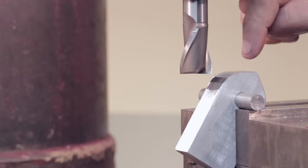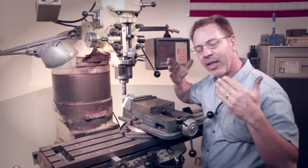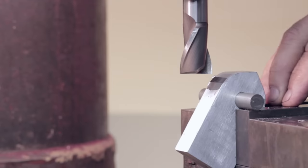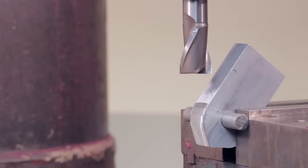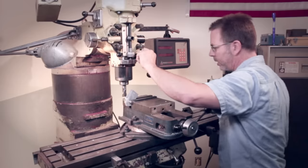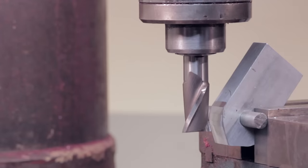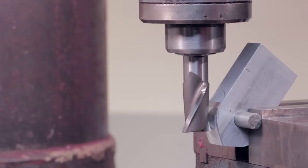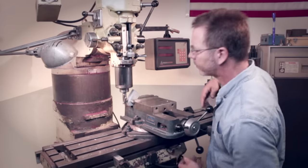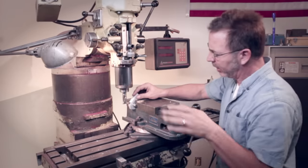You can now see how that radius is developing, but now we have a point on the top that we have to eliminate. You're a machinist, guys — think outside the box. I'm showing you the pin on top. Let's change that around and go this way. We're going to realign, pick one of those facets. Back it off a bit. We're going to tighten the table. Now we're going to switch handles that we're going to turn — again, it's the same theory.